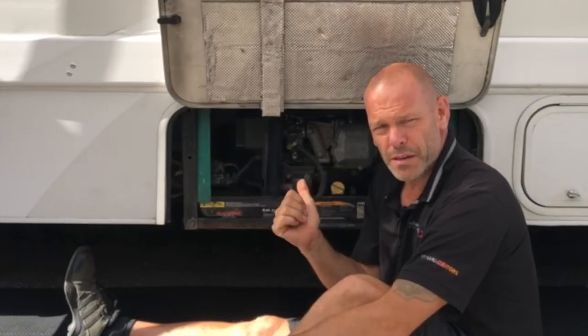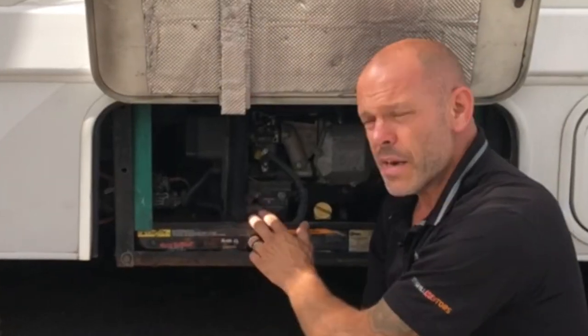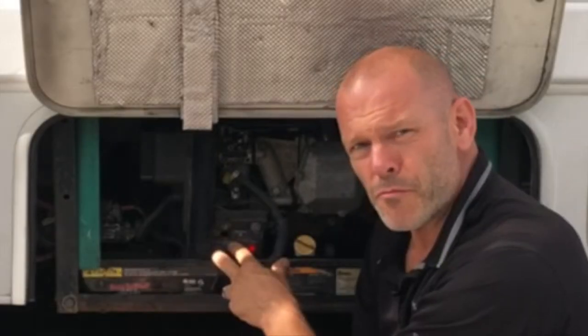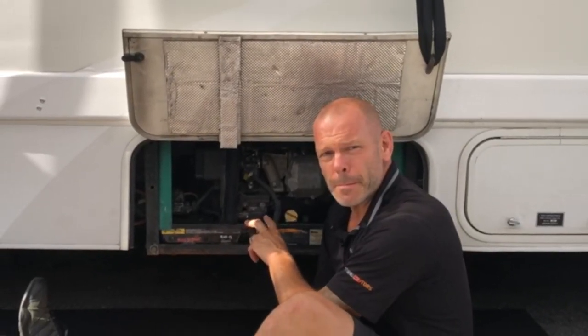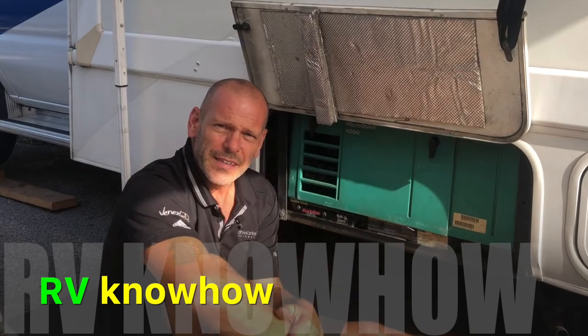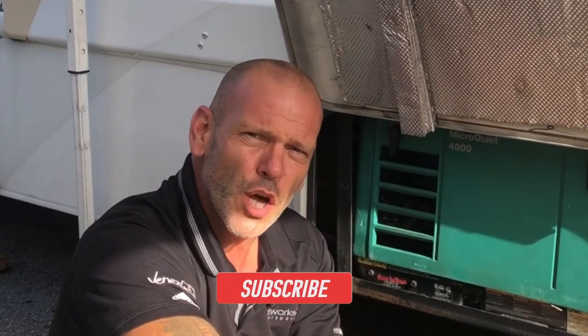It's all back together — we've connected the battery and we're almost ready to start it. What I like to do is hold the prime button to start the fuel pump going and check for leaks — you can hear the pump running. Have a look inside the cavity where we were working, and go underneath and check the fuel line. Once you've checked the fuel and you're happy everything's okay, go ahead and fire it up. Well done! I hope that was helpful — if so give us a big thumbs up and remember to subscribe for more RV know-how.